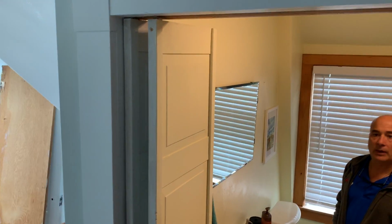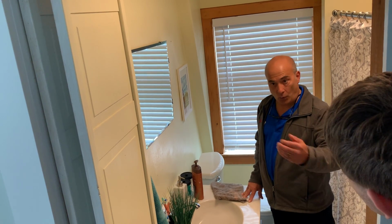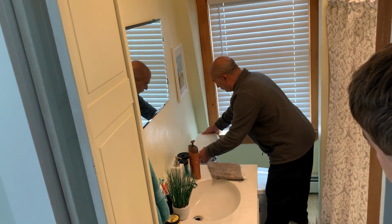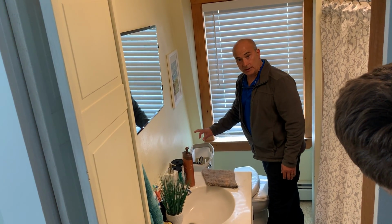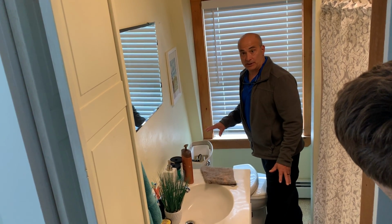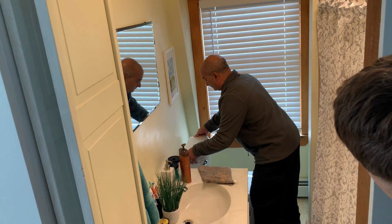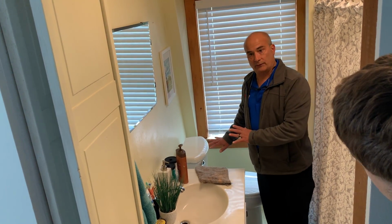First thing I want you to do is to make sure that you have toilet tablets. So the first thing you're going to do when you walk in, you're going to say to the customer, what I'm going to do is I'm going to drop a tablet into the back of your toilet tank. What that's going to show me is if there's any leaks happening that we don't see. So you drop the tablets in. Okay? Tablets are in. Forget about the toilet for a few minutes now.